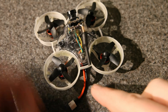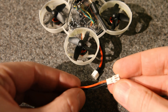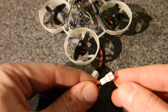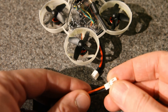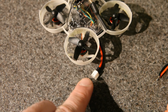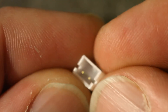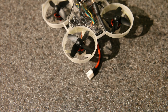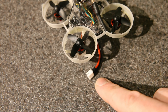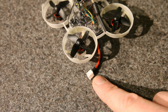The last thing I want to talk about today is the pigtail connector for the battery. When I first had this drone it had a connector like this — this is what's on most drones today. They feel pretty nice, but if you look inside, these have folded metal connectors; it's part of the crimping that makes it up, and I think they're cheap to manufacture that way. Some time ago I switched to these — the official PH2 connectors designed and manufactured by JST. They make a more secure connection and have solid pins on the inside. Back when I made that change I felt like there was a significant reduction in voltage sag, and I've talked to lots of people online who have done the same change, and every single one of them has said that switching out just the connector made a big difference.